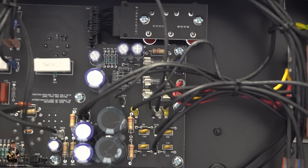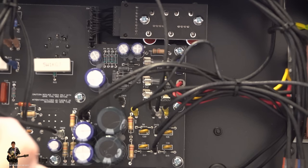Now, it always amazed me about these amps when I used to look into them, how some of these little components were standing off the board and things like that. And I did have one of them where the legs were touching, but I was quickly corrected by Marshall, saying that it makes no difference, because that's part of the same connector. So if you look inside your amp and you see things like that, don't be too dismayed, because the fact is, it doesn't make any difference.